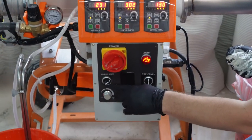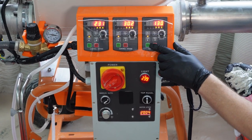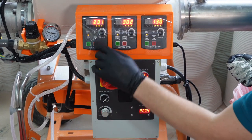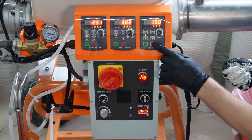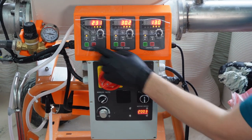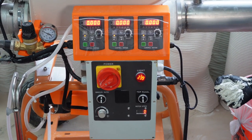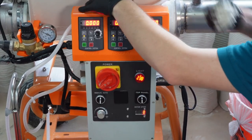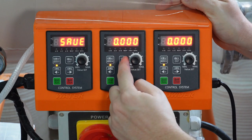Now we are going to show how to pause the mixer. Please note, you cannot pause indefinitely when using cement with mixed-in accelerants. You can only pause for a maximum of 10 minutes. If you pause for more than 10 minutes and you are using Cica 752 or Cica 733, you must stop and clean the machine. To pause the machine, press the red stop button on the motor controllers and flip the mixer switch to the middle position. When you are pausing for the first time or shutting the machine off, you will want to save the numbers that are on the display. These are saved on the motor controllers, but you should also write them down. Saving these settings will help you the next time you want to start the mixer and provide a good starting point for the work day.